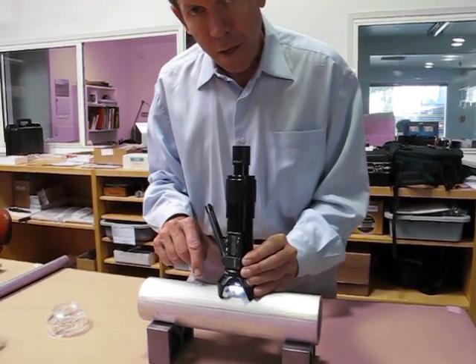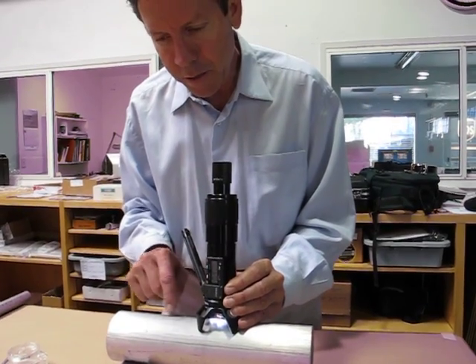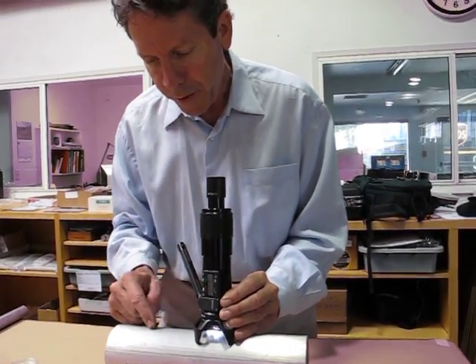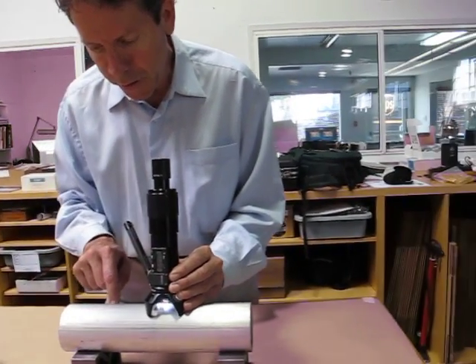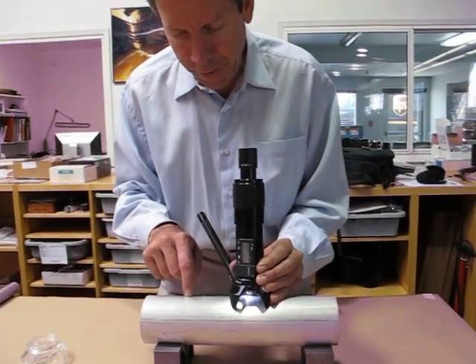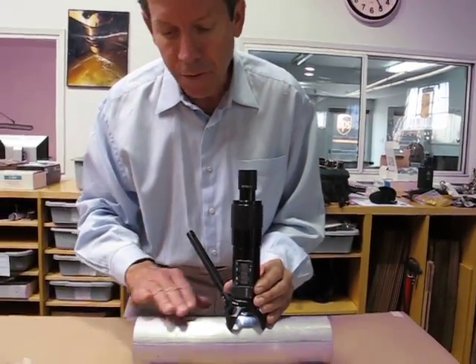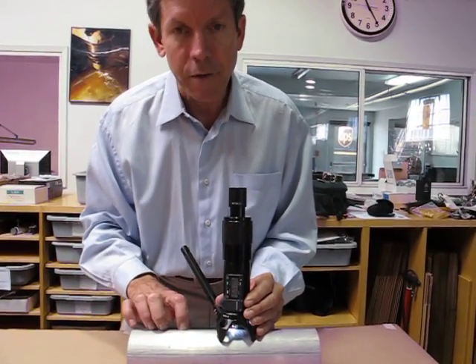This shows how you can use the micrometer on round shafts. What I'm doing is when I pick the good surface next to the scratch, I'm going to the left or right along the top of the curve and then down into the scratch. Because if I go across and then down in, I'm going to introduce some error because of the curvature. But if I go left to right along the high point, I will get an accurate measurement of the depth.